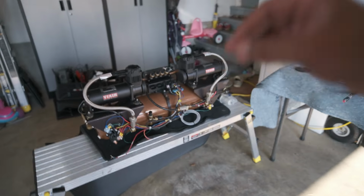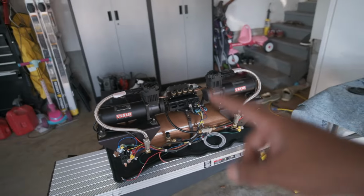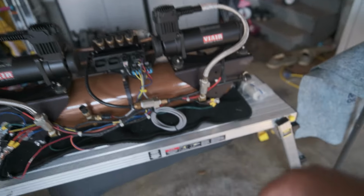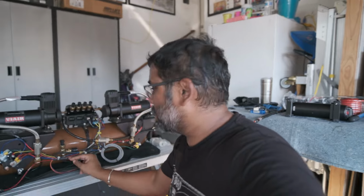With the small leaks, I got it down to a very slow leak and I could have taken it to IA. But because of this copper clad aluminum BS, the pumps were running so much and pulling so much amps for two reasons. One was the BS 4-gauge CCA wire, and two was what I came to find out was a very poor ground on the system. So that was a huge bottleneck also. The high flow off the 4-gauge and then the restriction off this 12-gauge. Because of those two factors, the supply wire, the pumps, everything is running so hot.